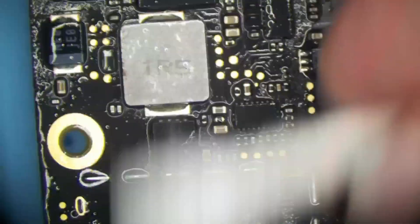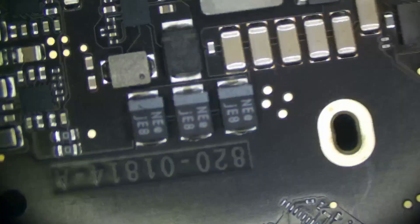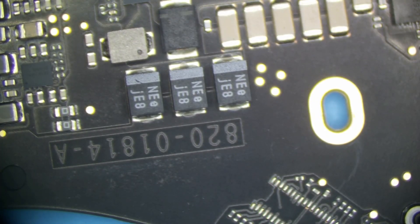That should be good to go. I'm not concerned about corrosion under any chips — you don't typically see that with condensation damage devices. So I'm not going to ultrasonic this; it's really not necessary unless there was liquid ingress. We should be good to go. Let's put this board back in the enclosure and see if it boots into an OS. Our board is back in the enclosure and we have a fully fixed MacBook with the data fully recovered. Remember, no matter who tells you it's not possible, there's always hope. If Apple tells you your data is gone, always seek a second opinion — there's a good chance your data can be brought back by somebody who knows what they're doing. Thank you for watching.